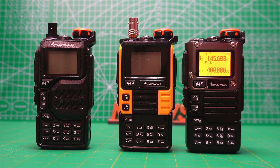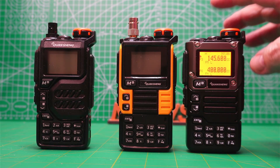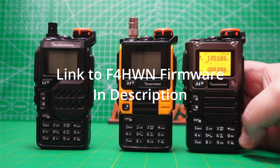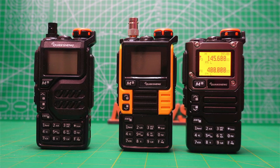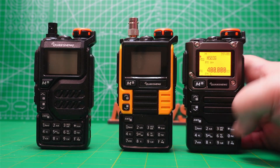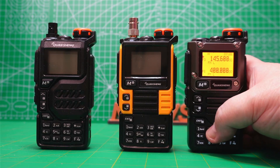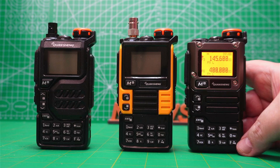This brings me to what I love about the radio: it is supremely hackable. There's a lot of custom firmware available for it. I have custom firmware on this UVK6 or UVK5 8, and it solves the problems I just talked about. For example, the display is on permanently — it doesn't time out at five seconds. If I want to switch between VFO and memory mode I just hold down the key and it switches. No two keys necessary. Same thing with A and B and even frequency copy — you just hold down the 4 key.